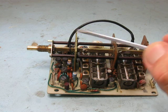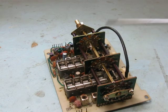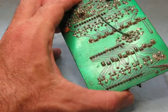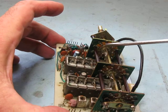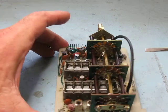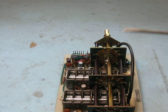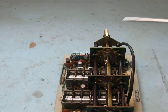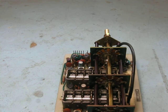On the other side there's another disk with another set of contacts. So on this bank of switches, they've gone to the trouble of earthing the coupling shaft between the wafers, and each of these back set of wiping contacts is earthed. When you look underneath, that single wiping contact — which is here and here and here and here — all go to earth. So you've got disks on the back connected to earth, and they in turn have been soldered to the shaft. This whole shaft assembly is earthed by virtue of screwing onto the plate, which is one of the points of attachment to the transceiver.